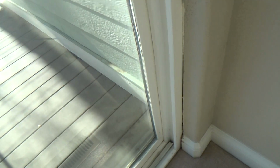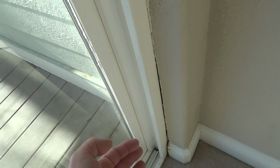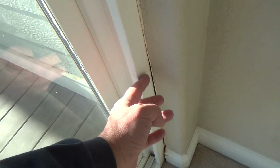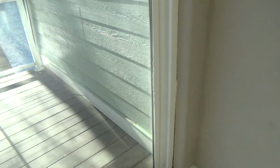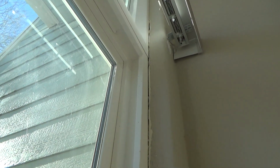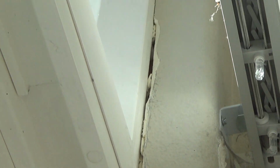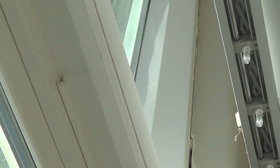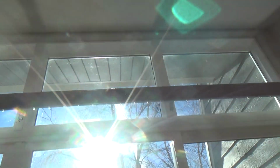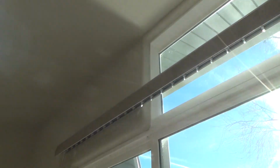In fact, I'll put 2 coats. I'm gonna put 1 coat and kind of spooge the first coat in a little bit far in there and try to build up the back side before I put a nice even bead around the rest of it. See there, I went all the way up and scraped off any loose bits, and I'm gonna recaulk all that. It looks way nicer if you do that, and your paint job's gonna come out looking good.